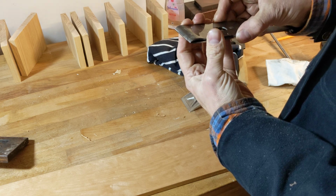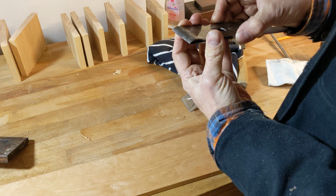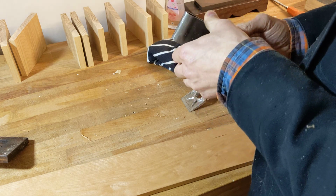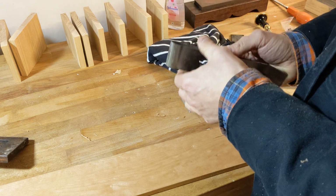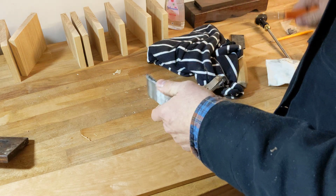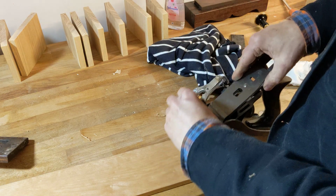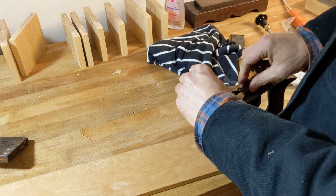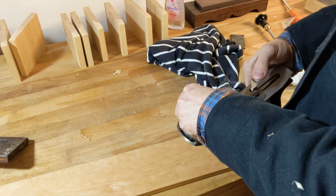And the reality is, certainly with hand planes, especially with hand planes, to get a good surface finish, you need to be doing things like reading the grain direction. That's going to be important. Learning how to set the cap iron. I'm not going to get deep into that for you now. That's for another day. I just want to show what Norton India is capable of. Making sure that the sole on your metal plane is waxed. All those things are of more importance.